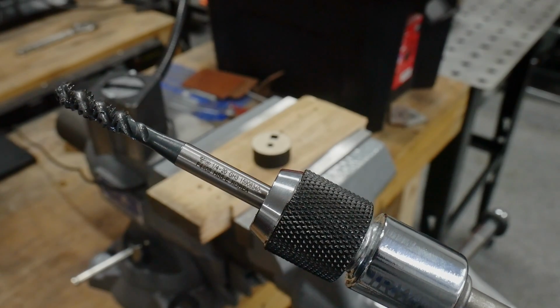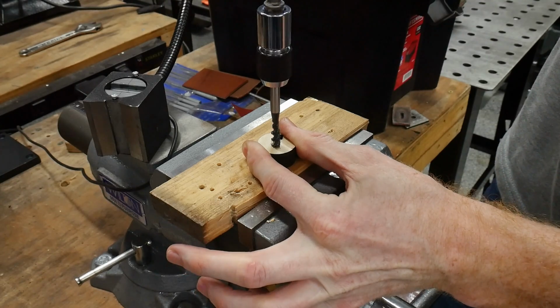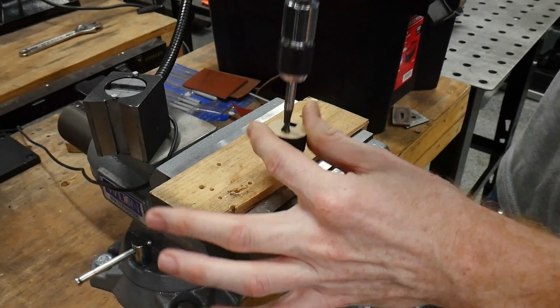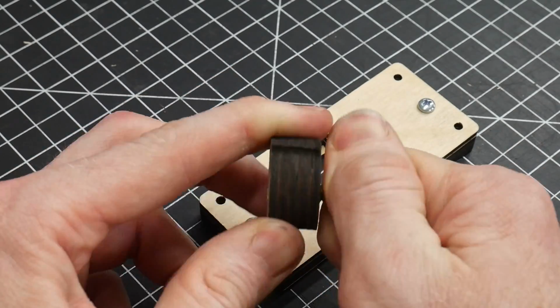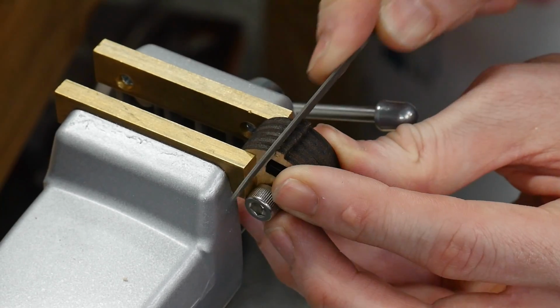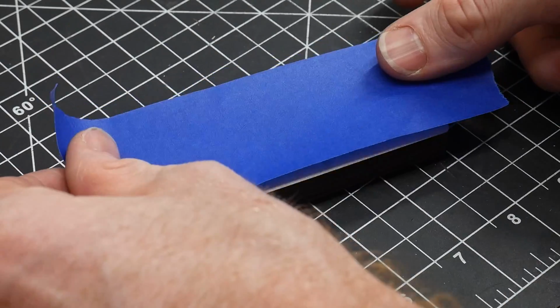I tapped the number 7 laser cut hole to a 1/4 thread. This allowed me to use a cap head screw to aid in hub strength, and also gave me something to hold onto when using the jig. There is a lot of force being applied around the hub with the hammer and punch, especially if you have a miss hit. I found that this cap head screw improved the strength of the hub greatly.